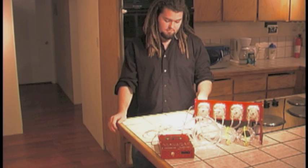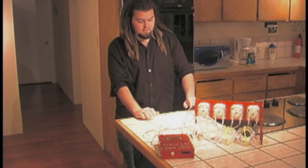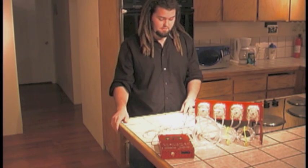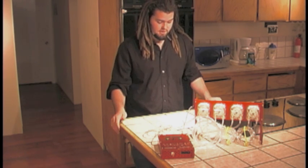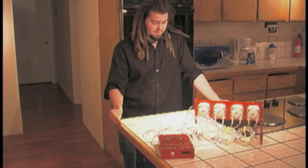Each pump can be pre-programmed per grow week cycle over a period of 9 weeks per grow cycle. The nutrient amount per week can be modified to exactly what the specific species of plants requires, and if any of the weekly nutrient amounts are modified during the grow cycle, it will save for the next one.